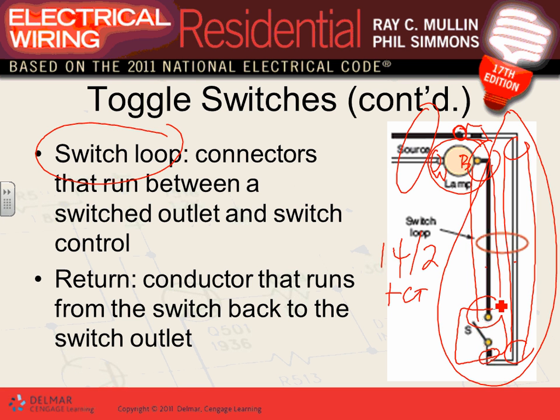When you put two conductors in one cable, the hot and the neutral will cancel the magnetic field in the circuit, or minimize it, so they don't induce voltage into the conduit. That's the induction heat concept. That's why, with the hot and the neutral in the conduit or cable, you also have to include the equipment grounding conductor in that cable. So when you put three conductors, all the conductors of every branch circuit or feeder must be grouped together.